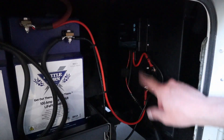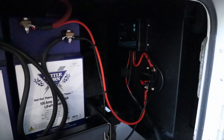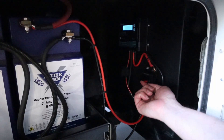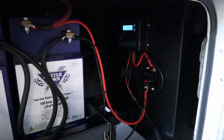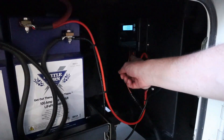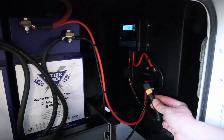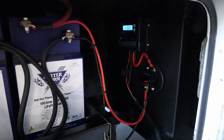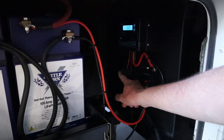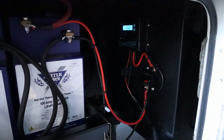So that's the battery. Whenever this is not in use, we just turn it off from the switch so it doesn't have any drain on the battery. And whenever he's going to use the solar panel, he'll just flip that on and the charge controller turns on. For solar, it's very easy — you just have the two pigtails coming off. We've opted to go with XT60 connectors so it's easy to connect up with his solar panel. There is a 20-amp inline fuse on this 12-gauge wire, so it's good for 20 amps.